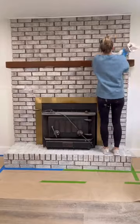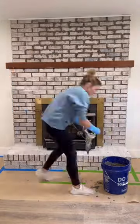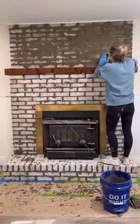After that, mix together a bag of mortar, grab a piping bag and gloves, and then began piping in between all of the cracks. I let my mortar sit for about 10 minutes before coming back with a wet sponge and wiping it. I was going for a German smear look, so I was purposely trying to get a little bit of the mortar on the front of the bricks.